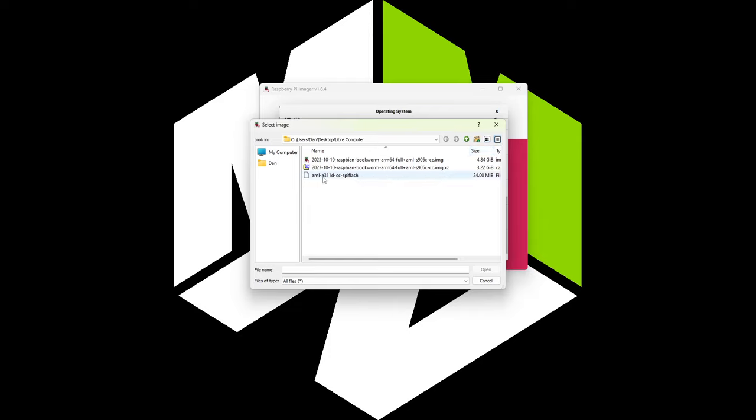Realistically we don't have to connect to the internet for this part, but it does make it easier because then you can just download the ISO file directly to the board. The other option is to take that ISO file and move it to a USB flash drive, then plug that in. If the Wi-Fi doesn't come up quickly we'll go back to that step instead — I'll give it a minute and see if it picks something up.